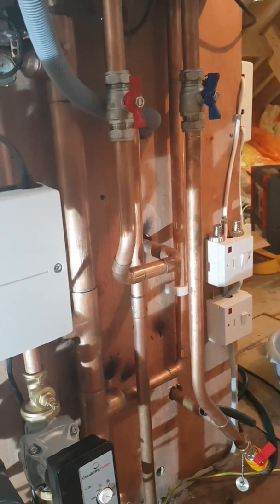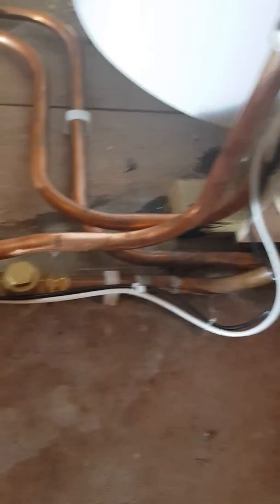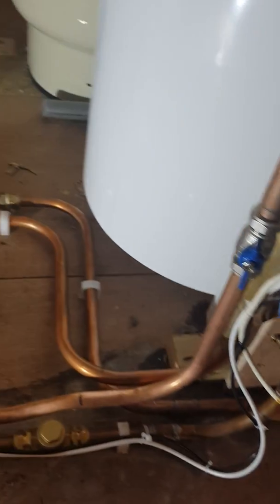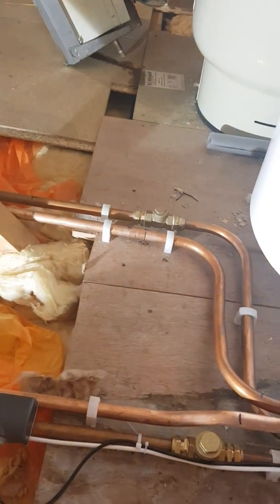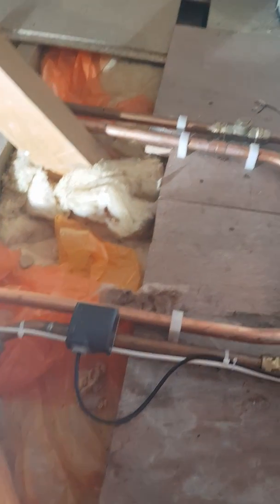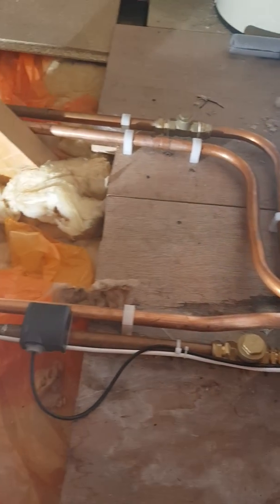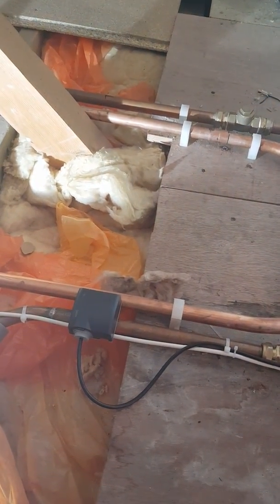So that's all come out. I did have two pipes going down to my underfloor circuit from the loft already, which was very convenient, and those two there to do the radiators. The first floor is completely underfloor. The top floor is radiators, so you can see two non-return valves in there and a pipe sensor there to pick up the flow temperature.